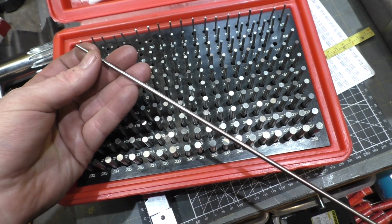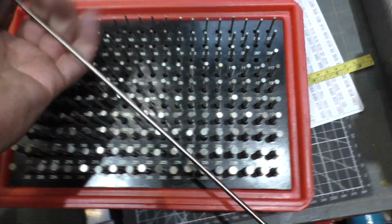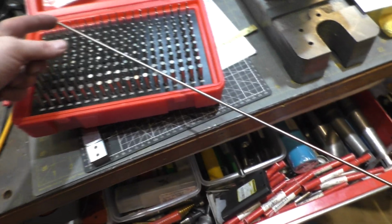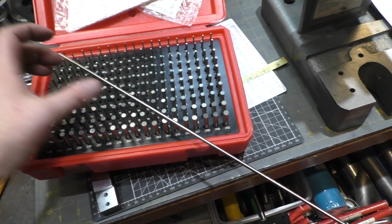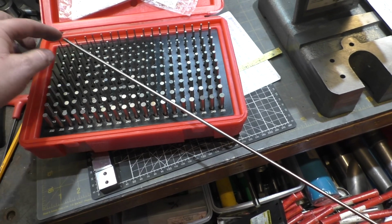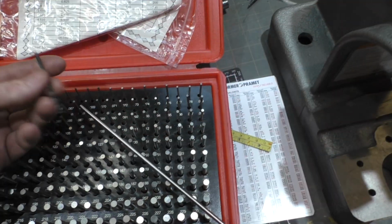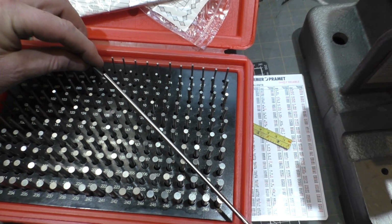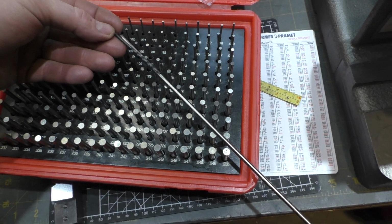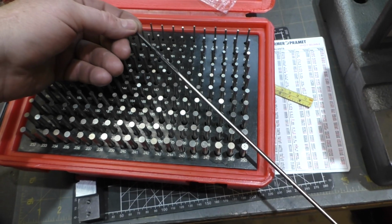First up, trying to find the inside diameter of this material made of Inconel, and it looks like it's 116 thousandths. This pin gauge fits perfectly, and I can't get 117 in it at all. So what I'm thinking is I somehow have to make something 116 thousandths that'll fit inside, so that I can squeeze on it, so when I cut the top, I won't have any problem with the material collapsing over the cutter. Let's see what I can find. It turns out that 0.116 is a number 32 drill bit, and this fits perfectly inside. So I could use this to squeeze in a vise and squeeze the material onto this, and then not have it deform the inside too much.